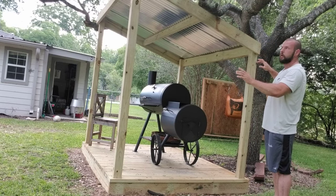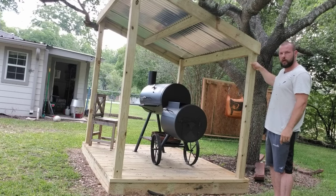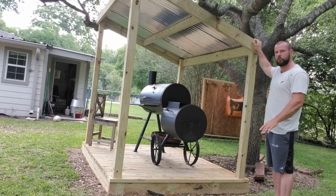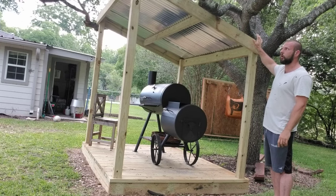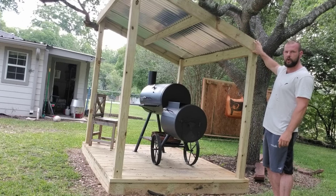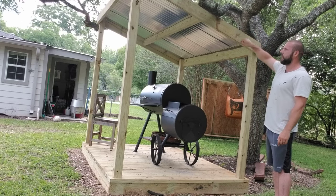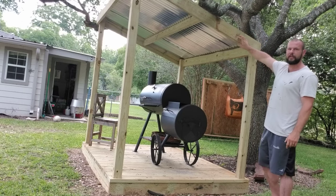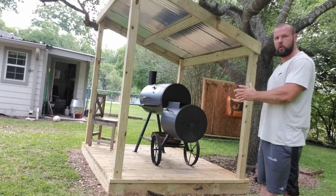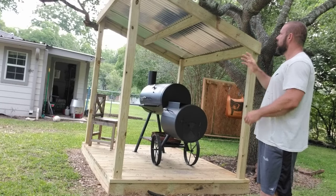Take it off, then you can cut the front of your two by six. Take it off your four by four and cut the angle on it so you get the exact angle you want. You're not guessing what degree — you pretty much have your degree, which is 15. But if you want a greater pitch, you could bring it down a little more or bring it up a little more. You have room to play. Then take that piece, your two by six, and cut your next one. Now you have all four posts cut exactly the same on both your two rafters.